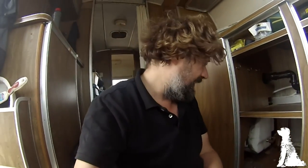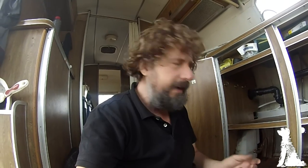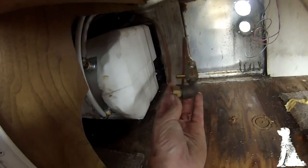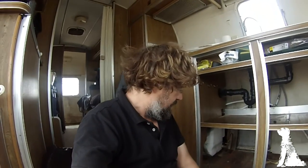I'll show you the real reason I had to get this heater out of here. I've been using this heater up until a couple weeks ago, and it had that kind of propane-y smell — like, is that combustion propane or raw propane? Well look at this fitting: it was completely split and yeah, I was hissing propane into the trailer. Gotta up the safety around here — anyway, that's what I'm doing.